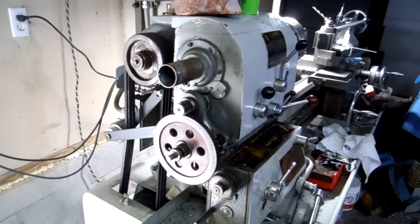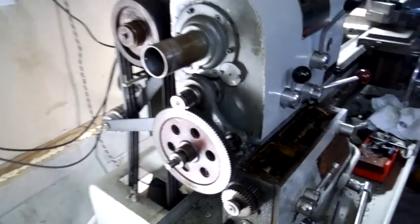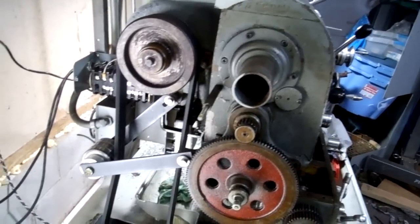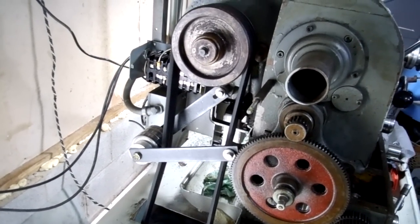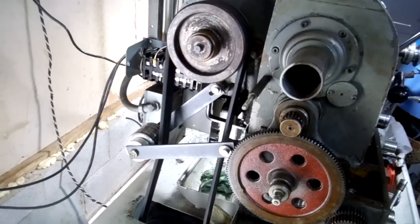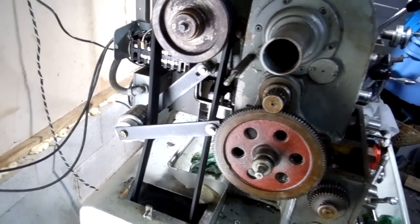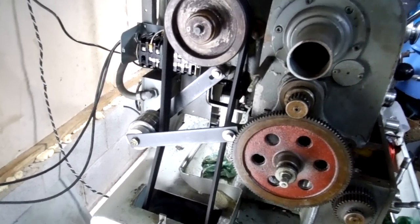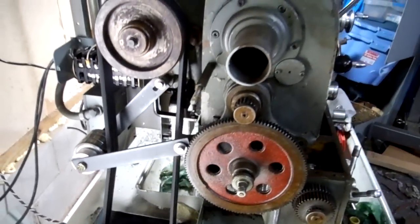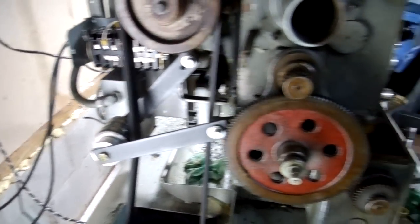This is a 1966 Colchester. You can see I've got the back cover off — I wanted to make a tensioner there. There are three belts on this particular model, and what I found was I was getting a lot of belt slip creep which caused a certain amount of vibration — it was really strange. These are new belts. So I came up with a gigantic bearing pulley assembly, three bearings stacked next to each other, and this makes the lathe smooth running — unbelievable. I had to cut out the cover partially for this tensioner.